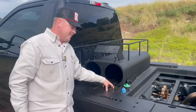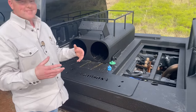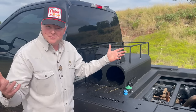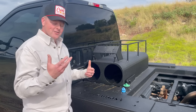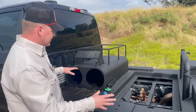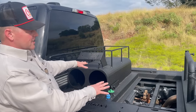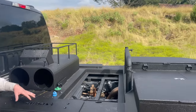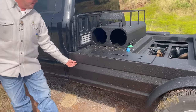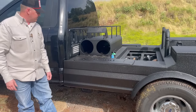The top deck is quarter-inch plate. A lot of people asked why I went with such heavy plate — when it comes to custom fabrication I try not to worry so much about weight because my old soul wants things to last forever. I just wanted it to be solid, so we went with quarter-inch on the front top deck and the back as well. This panel that Stillwater Steel broke for us is 14-gauge because they couldn't get some of these small lines in the roll with anything thicker.